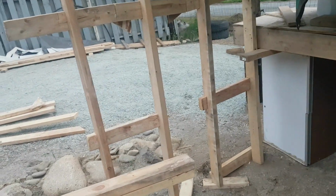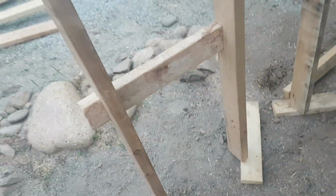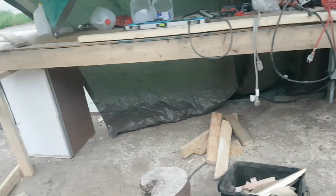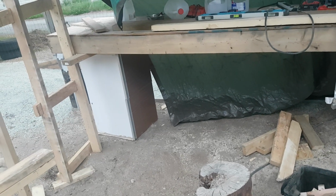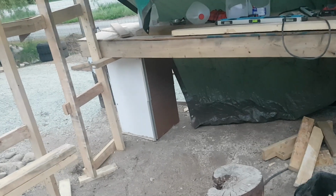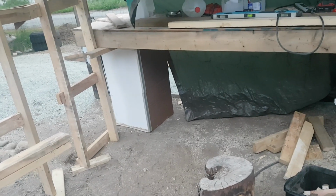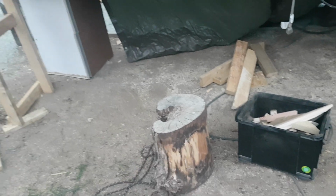And the reason for that, you could actually make a simple truss system, 16-inch truss or maybe a 24-inch truss floor system that go right across. That eliminates having to mess around with the floor panels. Well, you could have floor panels that drop and lock over top of the trusses. I think that would be good, and so that brings you off the ground.